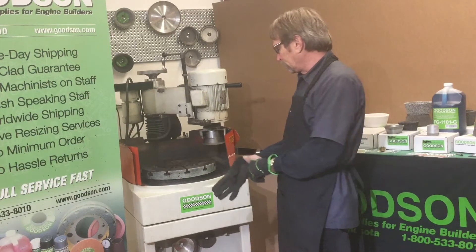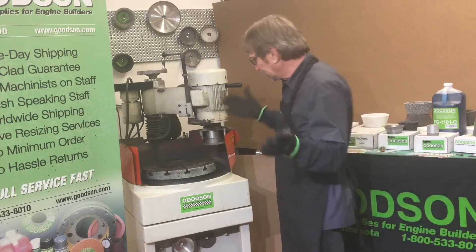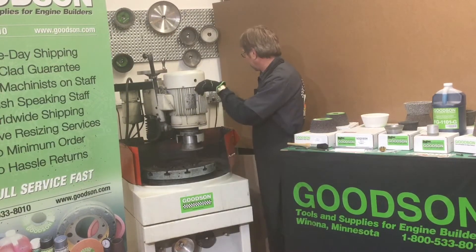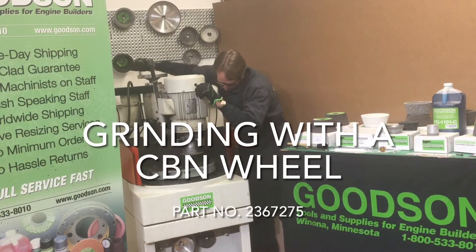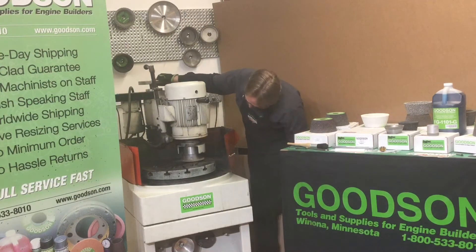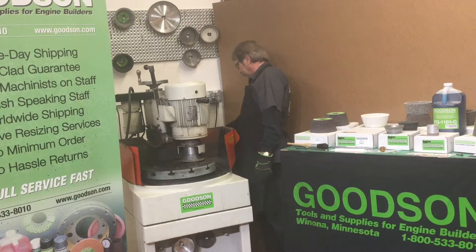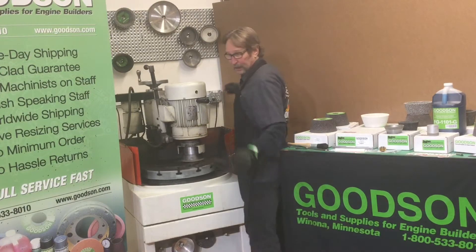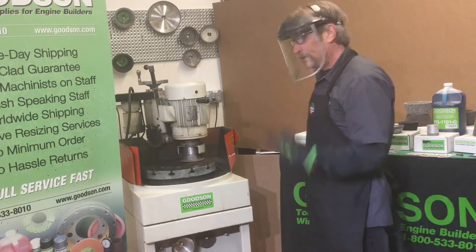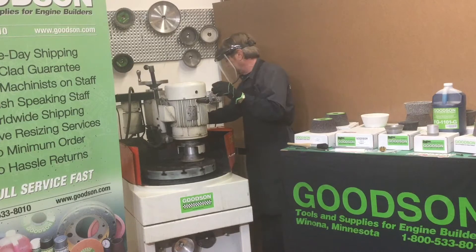I still like to put coolant in the equation, making sure that everything is ground with coolant — that's just how I roll. I want to get this thing centered over my workpiece, so I'll go ahead and send this head on down. I want to get it in close proximity to the workpiece before turning everything on. Once I've got that going, I'll get my coolant going and my table going. Safety first, guys — make sure you've got your safety goggles and a face shield on any time you're grinding. Get your guards in place and lock your head down.